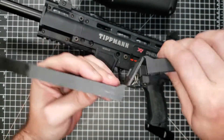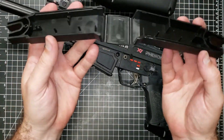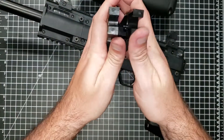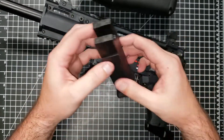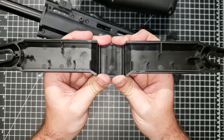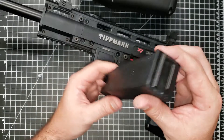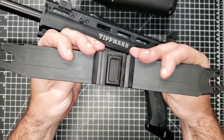Eventually, if you cycle it hundreds of thousands of times it's going to break, but that's not what this is meant to do. This is injection-molded with an A-half and a B-half side of the mold, and then they pop it out and that's it. The amount of money that went in — this probably costs less than 50 cents per piece. The tooling costs money to make, but you could make millions of these and the tooling cost becomes almost negligible.